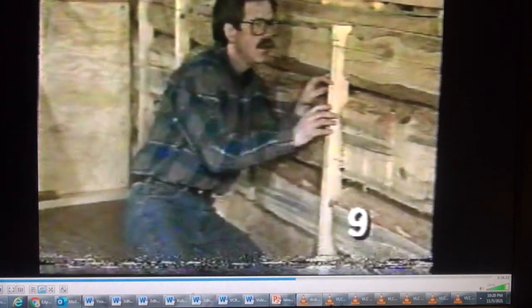The nailers get put into notches that we cut out of the logs every two feet on center. It's plumbed and it looks good. For nailers, we're using 2x4s that are ripped to the correct width to keep all the front edges flush.